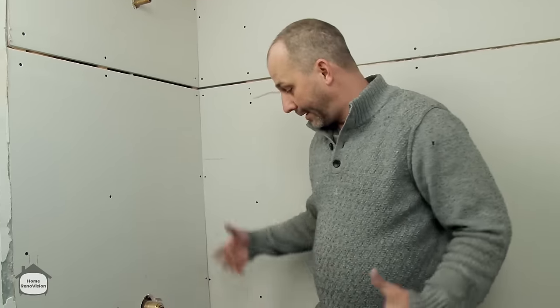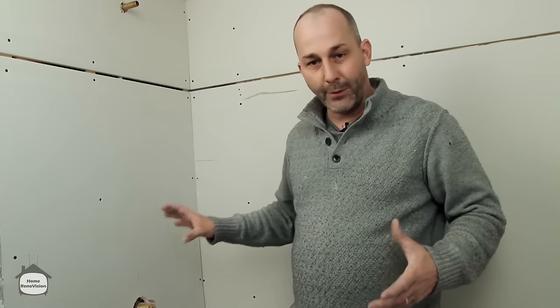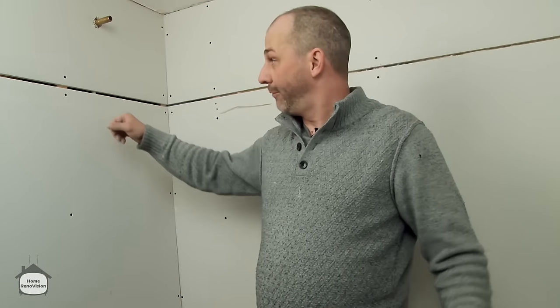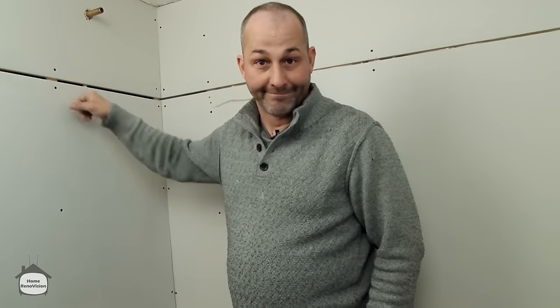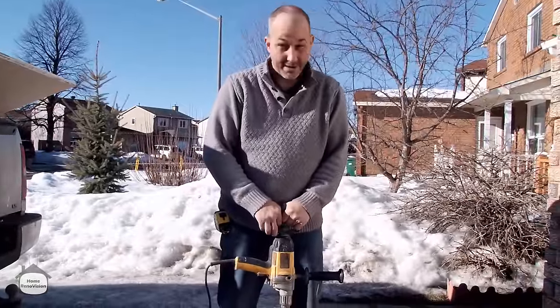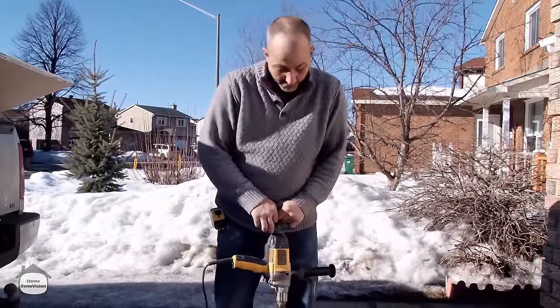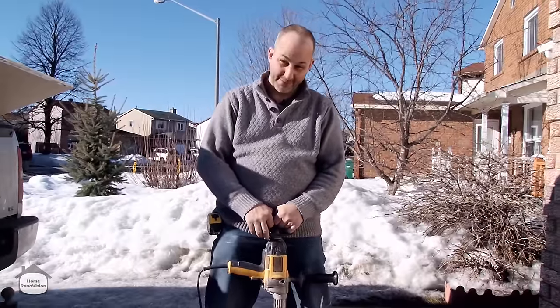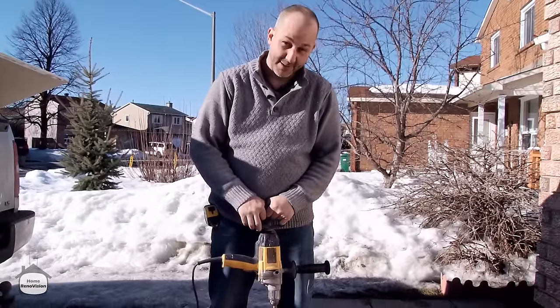So because of the nature of our environment here, we're just going to go with some simple white glazed tile and make it nice and clean. And hopefully in a few hours, we'll have this all closed up. The Kerdi membrane system requires a non-modified cement, or in other words, cement. It's been like that for a few hundred years, ever since the Romans started building tubs.